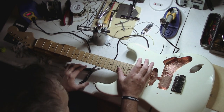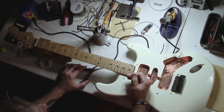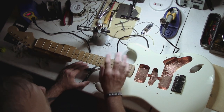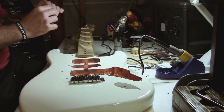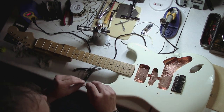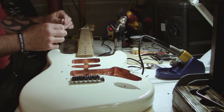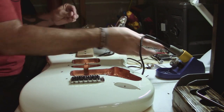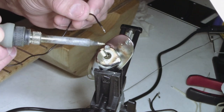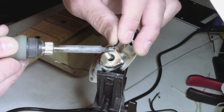When wiring up guitars, you don't have to use different color wires — there's no such thing as ground, negative, and positive wiring here. You can use the same color wire as long as you know what's what. But I always use black and white wiring for simplicity so that once things are inside the guitar body I know what's what. You'll need about 10 inches of wire. We're going to use the black piece first for the ground wire coming off the input jack. We'll heat the inner lug, push the wire through, and curl it up.